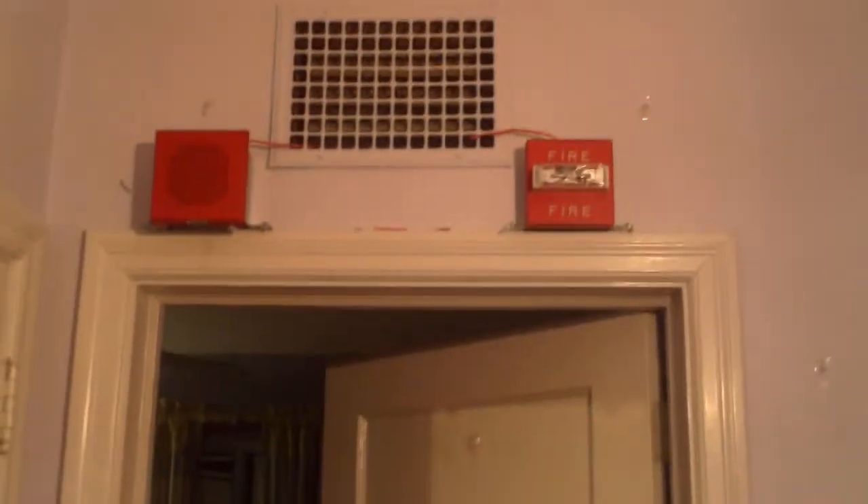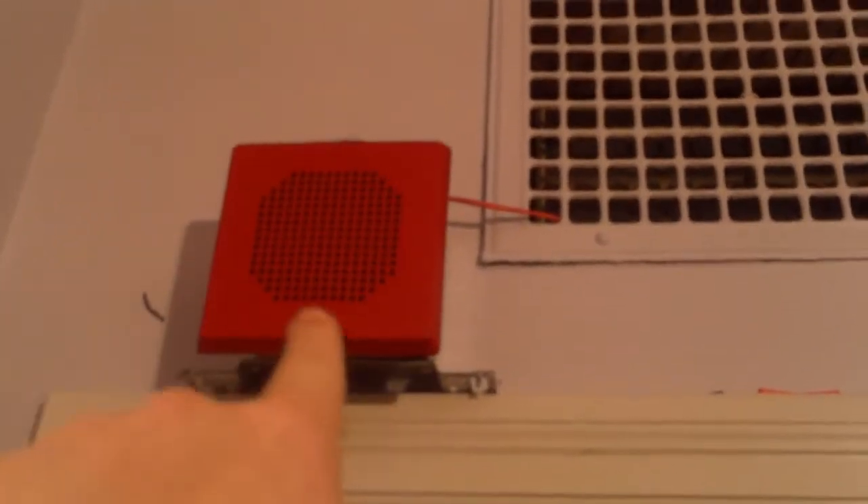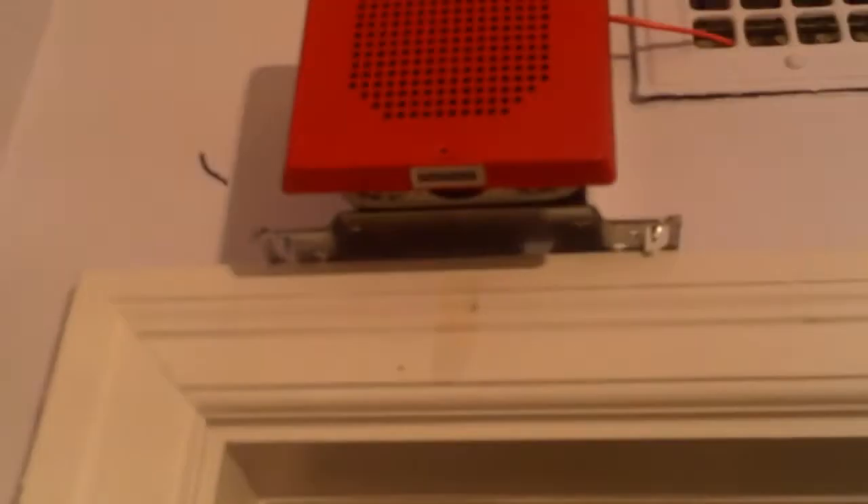Here's another part of the extension — you've got a wire going in there and coming over here. I got this new bell that is being controlled by the control module, coming out in the hallway. I put a Wheelock RSS strobe out in the hallway; it's set on the strobe circuit so it'll remain flashing when I silence the system. This is a Siemens CHR remote chime set on the highest volume, although you can barely hear it when that bell is ringing because it is extremely loud.